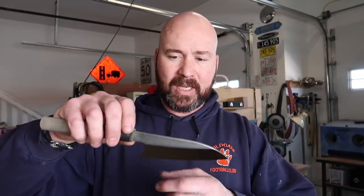So what I'm gonna do - and I don't know if this is gonna work - but I'm gonna try an edge quench. Essentially once we heat up the knife, get it up to the upper critical temperature, past critical, we are going to quench it, but instead of quenching the entire blade, I'm just gonna quench the blade edge. Hopefully that will give me a differential hardening and hopefully there'll be some type of a line that shows up in the steel. I honestly don't know if it's gonna work, but if it doesn't, at least we tried. Always fun to try something new. So let's get started.